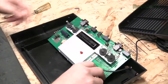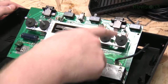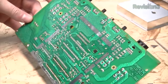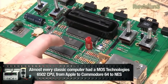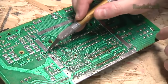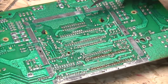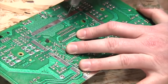Years ago when I first started modding, this was my first project. What I noticed on the Atari was that most of the circuitry is right here inside this RF cage. All this stuff can be removed, which we will do. You still see this today in electronics — there will be a ground plane which connects to the RF shielding, covering up the real guts, which are these three things: the processor, your RAM, and your timers. And this makes the video — that's all there is to it. It's time to slice and dice. This brings back memories. A lot of this area is just solid ground plane, but there are areas where we are cutting off traces, so we have to keep that in mind, although we don't need a whole lot of this stuff. We mostly need one of the joystick ports and the select/reset switches, so this is all pretty easy to rewire — much easier than a modern game console.